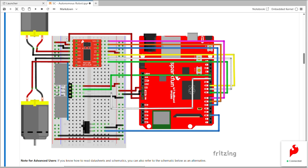VIN will have a high voltage to give our robot more oomph, but it only has that voltage when the battery pack is connected. Make sure that your wires don't get in the way of your distance sensor, or it will constantly think it is encountering an obstacle.